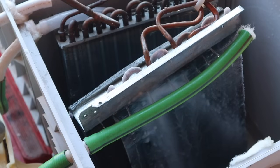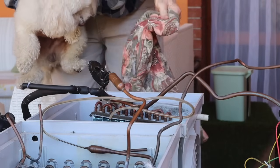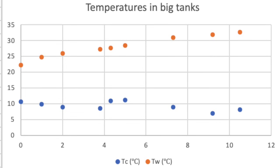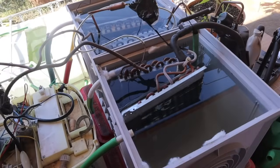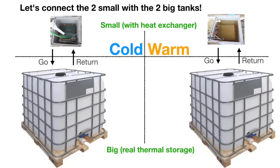I found a new idea to avoid icing of the evaporator, which reduced the overall COP — the energy multiplication factor — to two. I tried the shower for the heat exchanger instead of the bath. The COP is the coefficient of performance. If the COP is 3, then a heat pump with an electric power consumption of 500 watt — our case — will give 1500 watt of heat. I show you how to combine two or more of them in a modular way to consume all excess PV electricity under your command. That's measured again as a complete system with the big tanks; we will disregard the production of cold because it is becoming winter. You will see this measurement in the next video.